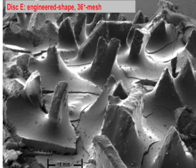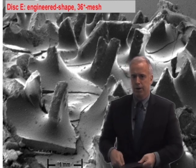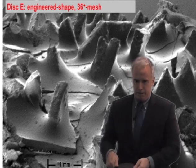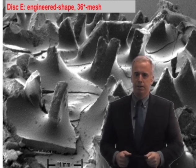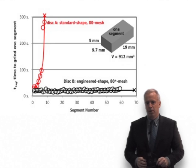What I did was I took a good old angle grinder. I got a welder buddy of mine — this is a coated abrasive disc — we got an angle grinder and we just started grinding segments. We did it with the Cubitron 2 disc and we did it with the regular aluminum oxide discs. What we found was: we ground with the regular aluminum oxide disc and the first guy cut, second guy cut a little slower, third guy took a little longer, fourth guy took a little longer, fifth guy took a long time, and finally it wouldn't cut anymore — we threw it away. You can see the results behind me here.